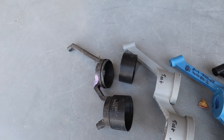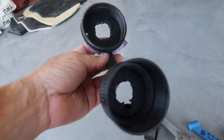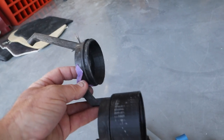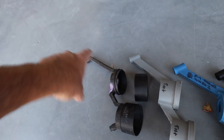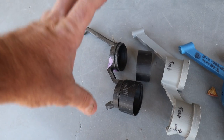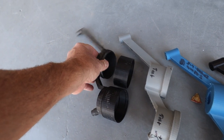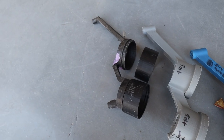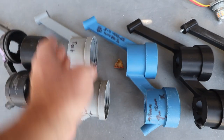Let me take you through the iterations of the prototypes so you can see how we got to where we're at. Starting from version 1.0, these fragile little things are what Nick and I originally came up with. They fit okay — the idea was these removable middle panels because the chassis was a slightly modified version of something he'd already created. Unfortunately the chassis was really thin and broke pretty quickly. So version 2 was a much beefier version, printed on a diagonal which makes it a lot stronger from a 3D printing standpoint.